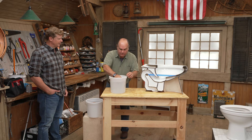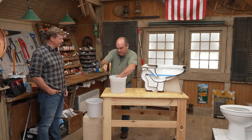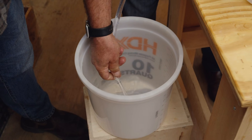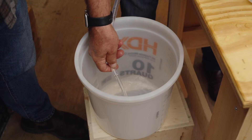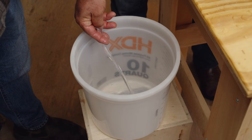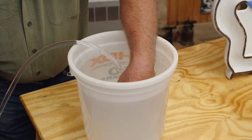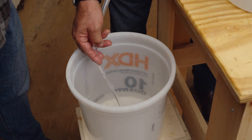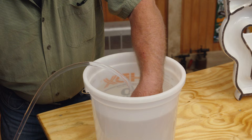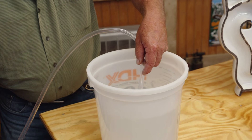I'll fill this with water. And this is the key to a siphon — you've got to actually have this water completely filled in the tube. So now, here it is. Now watch what happens. Look at that — it's just literally flowing all by itself. No pump, no nothing. It's just working. So it will keep on going until it goes empty or I break the vacuum. Watch this — as soon as that pops out and you get air in the tube, everything stops.